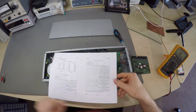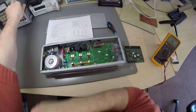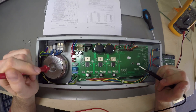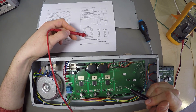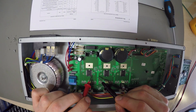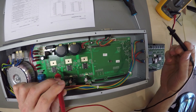The electronics box is a rather pleasant surprise for a change. It's fully self-contained, cleanly designed, and it uses L6208 bipolar stepper driver ICs. The only thing I don't like is this board on the right — that's a microprocessor board to plug in over the empty section. It probably has the step planner built in, like the Arduino Grbl project, and it probably uses a closed protocol to communicate with its proprietary PC software over RS-232.